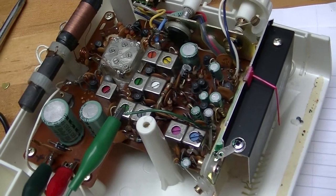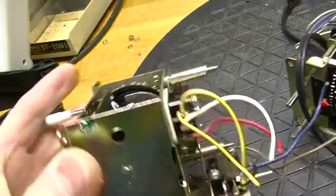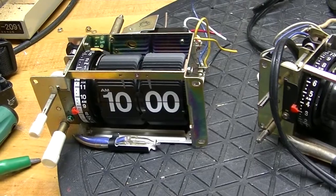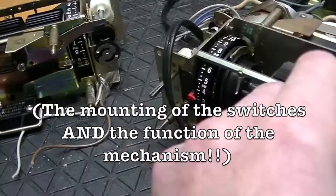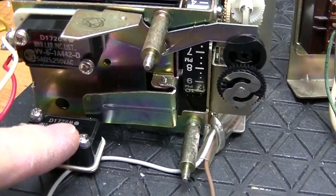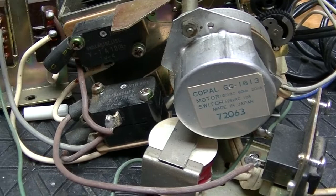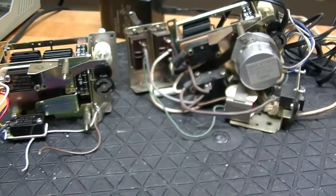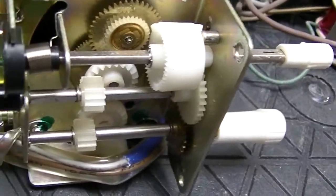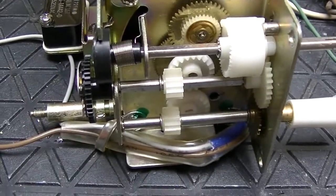It works — not very elegant, but it works. I've moved the motor off the new mechanism, and I'm thinking now that it might be easier to transplant not just the motor but also the switches as well, because the mounting of the switches is actually very similar. So I'll unscrew these screws and move everything over, which will probably give me a working mechanism.